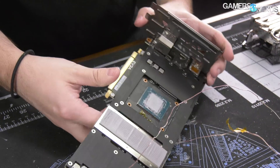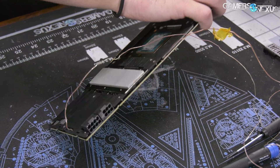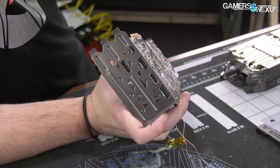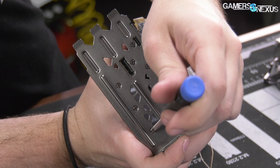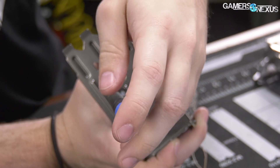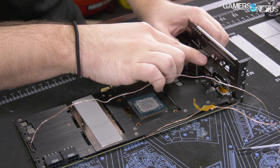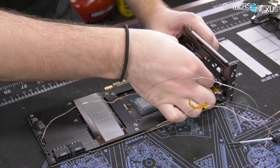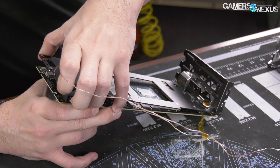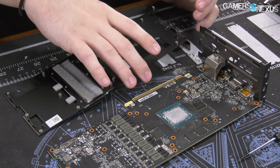On the top side, we can't remove the base plate just yet — first we need to remove three screws that are hidden in the back. The rest of them can remain. Once those are removed, the securing part comes off easily, and that's connected to the base plate. We've now reclaimed the thermocouples, and I can show you the rest of the board.